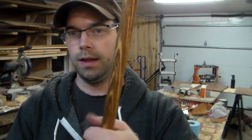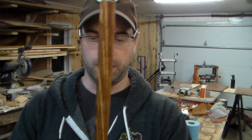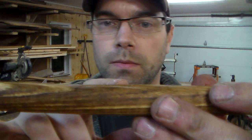So that was the creation of the zebra wood walking stick. Honestly, if I wasn't using power tools, it would be ten times harder to deal with this wood. Because even with the power tools, there are still several places where the bit chipped. Normally with a wood that has a more tamed grain direction, you just look at the board and the grain tells you the direction to go. But with this one, every three inches the grain direction changes, so it's really hard to work with. Anyway, hopefully you guys enjoyed the video — see you next time.